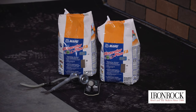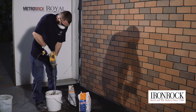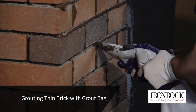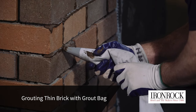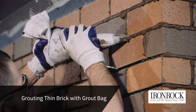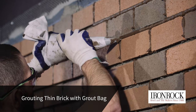There are a variety of methods for applying grout. Wax bricks are designed to be pressure washed after installation, and a full broadcast grouting method can be used with a grout float similar to grouting tile. This method can also be used for smooth bricks or if a wax grout release product is used on the bricks. For this video, we are bagging the grout into the joints to keep it between the bricks and off the face as much as possible.